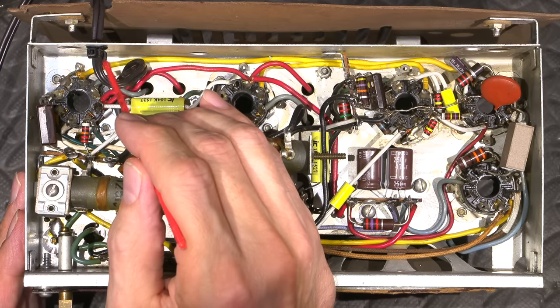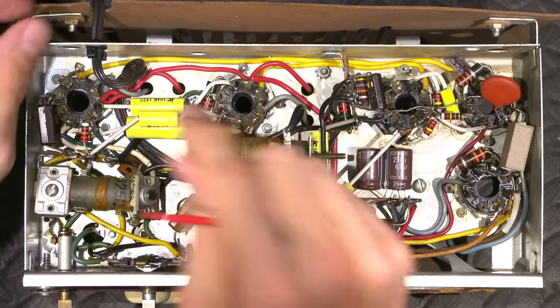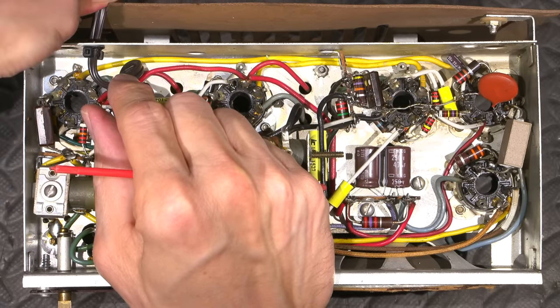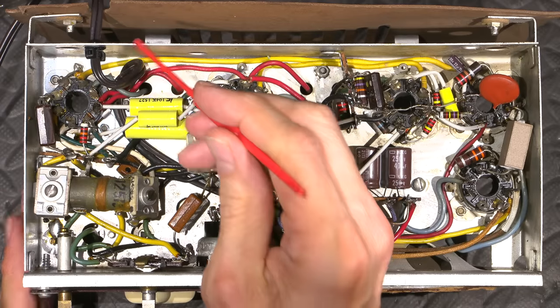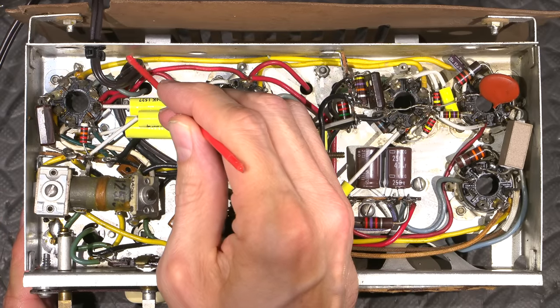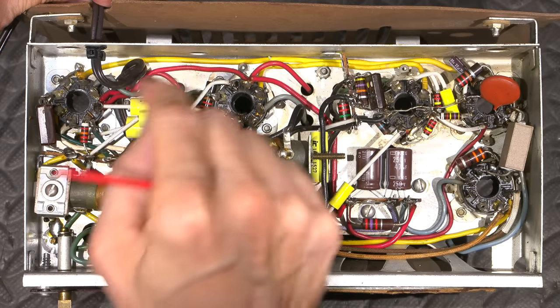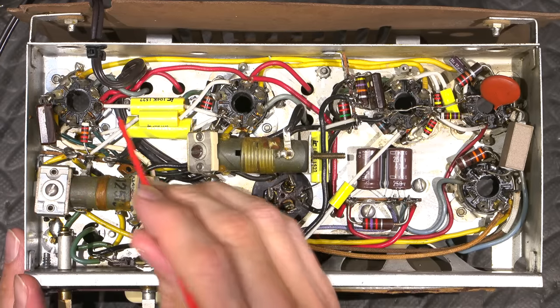There's two tie straps acting as a restraint, so they're both pulled together and tight on the cord. And before I'm done, this will get a dab of super glue as well. You can see that's very tight, no movement there whatsoever. There's a strain relief right here and a movement relief. So there's basically one turn as it goes down to the bottom of the chassis.